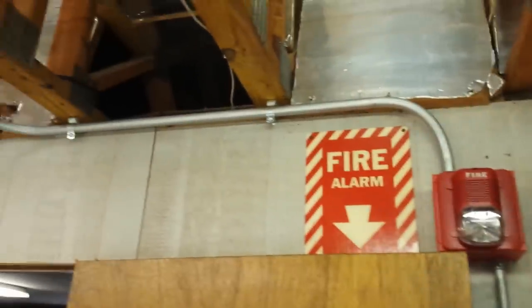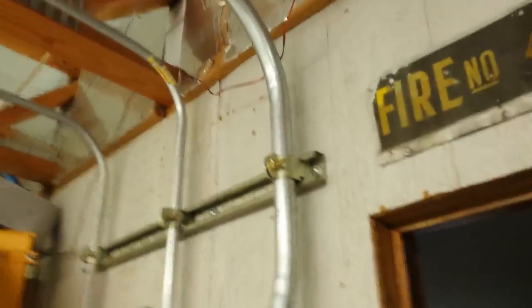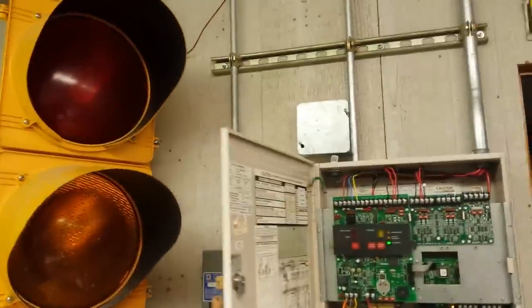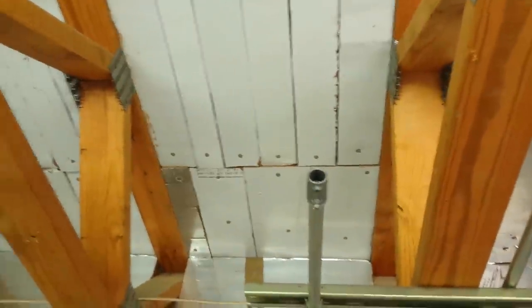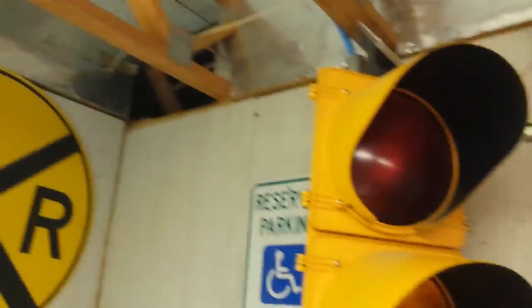Down here I have a 2099-9754 pull station. You'll see that there's quite a bit of conduit bends — 90s, offsets. This was a pretty difficult piece to bend. Everything had to be dead on and all my measurements had to be good. There's two 90s and then a ½-inch offset. With 1-inch conduit, it costs $7-something for a 10-foot stick, so basically I had two attempts at making this bend, or else I'd have to go get another stick. Half inch isn't quite as bad, but there's no reason people should be bending conduit incorrectly — just do it right. There is a ½-inch conduit here for power, but it's not going to anything at this time. This will eventually go up to an emergency light and/or exit sign, and someday I might use it to get power over to this junction box, which is for a sequencer for my traffic lights.